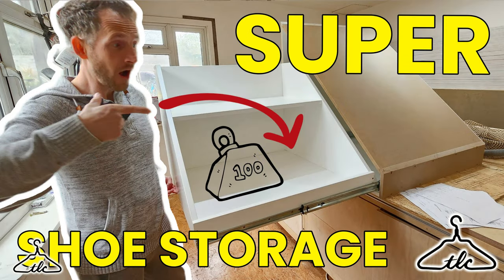Hello everyone and welcome to another video. This video is the installation of the unit that was being made and assembled behind me on the Ultimate Workbench. The unit is one meter wide by one meter high by 800 deep. The drawer inside is fitted with a pair of gigantic heavy duty runners from GTV — I'll leave a link in the description. They're rated to carry up to 100 kilos load. This video covers putting the bearers down, leveling them up, putting the unit in, leveling that up, getting the trims on, the fascia, dressing up, making it nice, and siliconing from start to finish.